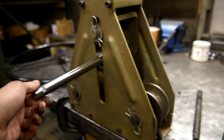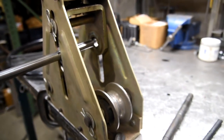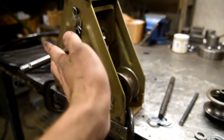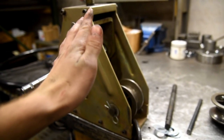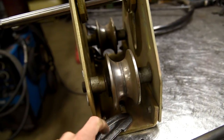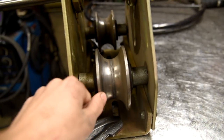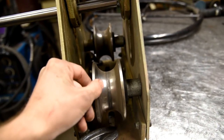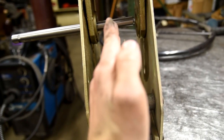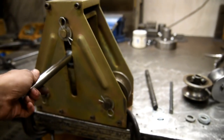In order to use that, you just have to get the shaft that they sell, which is slotted for the key. They told me over the phone that the major flaw with this is that when you roll your pipe and go to angle it up, sometimes it turns sideways and gets a little crooked. What they recommend is using shims — there's a lot of slack in there. My goal is to tighten these up as best I can so it keeps the pipe from rolling around sideways, so all these will be perfectly straight and it'll keep the pipe rolled straight on both sides.